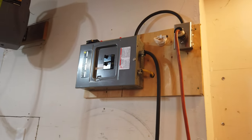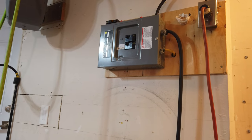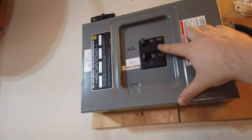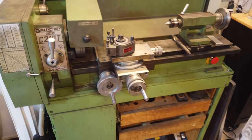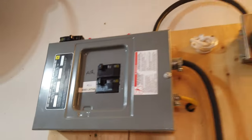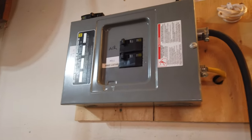I've got this little panel on the wall — this is just the sub-panel from my main panel in the basement. I've got 40 amps of 220 volts up here on two breakers. I've got two 20-amp breakers: one runs to my air compressor, and one runs the mill and the lathe. They both run on that same circuit, and the air compressor I've tucked away into the basement with airlines running up through the floors, which is really nice because it makes a heck of a racket.